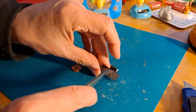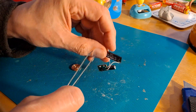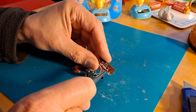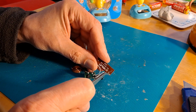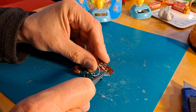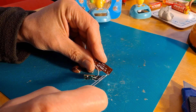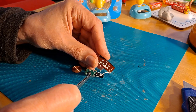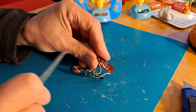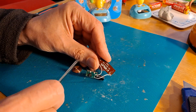The solar cell — if it's got a crack across it, you might as well throw it away because you can't repair a cracked solar cell. If you've been unlucky and it's landed on its corner and cracked the corner off, then the solder tag is left blowing in the breeze. You're not likely to be able to re-solder anywhere else on that board — those solder tag points are specific. The wire may have pulled off and you can just re-solder it, so there are six potential solder points that might need re-soldering or piecing out.